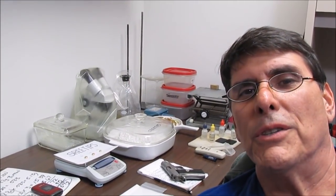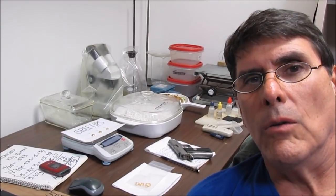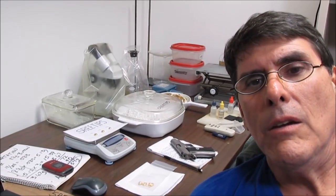This should conclude the series on the Alaskan placer gold. I tried to find a way to get the gold out of the placer gold, refining it with different methods. What I wanted to try to do was eliminate nitrate completely, but it turns out I wasn't able to do that. Maybe I didn't take the right approach or didn't wait long enough. Maybe if I leached the gold in the sodium chlorate for a longer period of time, I might have got a higher yield. Anyway, we're done with this one.